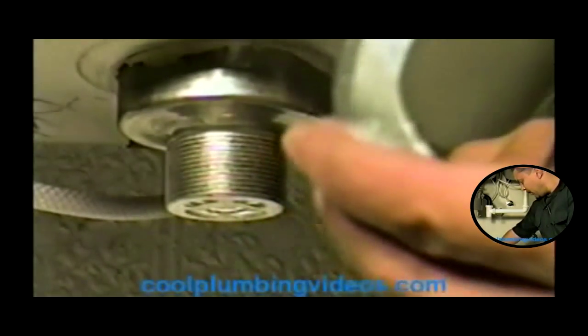That's pretty tight. Now let's go underneath and hook up the compression nuts. From underneath here, you can see that the putty is squished through. I usually just like to take my hand and just peel the excess putty off, because we're going to squish it down a little more when we tighten up the basket strainer from the bottom. Let's get that excess off of there. Now this part here is the bell. What I like to do before I put the bell on is take my pliers and kind of bend the ends of it, just go around bending the end. That way it'll give me a nice tight fit, because in some cases the washer on it is not enough to get it tight. See how I just kind of crimp the edges of that?